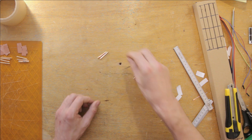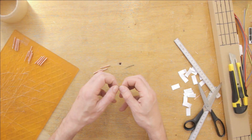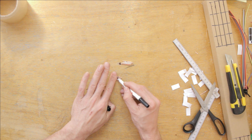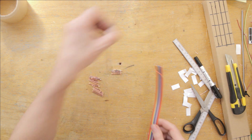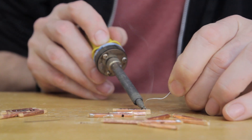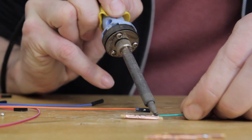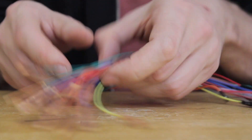That exposed end ensures that when you put the matches down end to end, the copper tape pieces don't touch each other. I'm feeling pretty good about these string sensors — the size is similar enough to a real bass string that they should be comfortable to play. I have to number these because they are different lengths. Before applying the dielectric layer, I need to attach a cable to each string section using my soldering iron. This copper tape is super easy to solder to. I apply a bit of solder to one end of the copper tape, lay down the tinned end of the cable, and touch with the soldering iron for a couple of seconds until the solder melts — and here are all 16 of them.